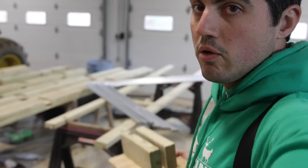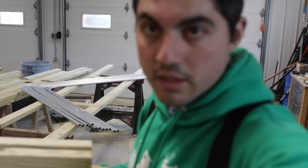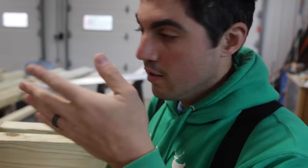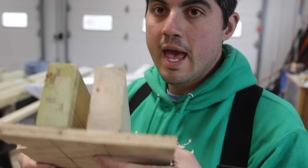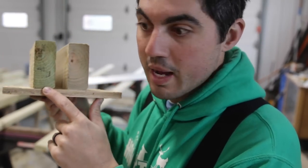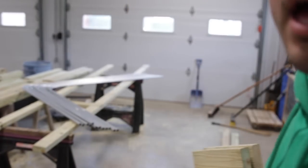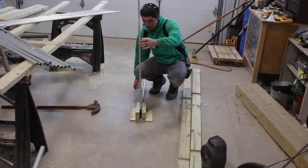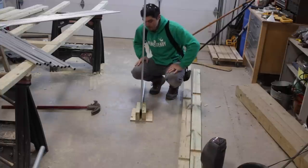I finished up all my 90-degree angle arches — I've got 12 of them. Now I had to make a little jig to bend the 45-degree angle. I took two scraps from the project, two-by-four scraps, and screwed them together on a piece of marine-grade plywood I had lying around. I made sure that a piece of EMT slides right in the middle. I can place it on the ground — bingo, that's what we want. That'll hold the 90-degree angle as I bend each corner.